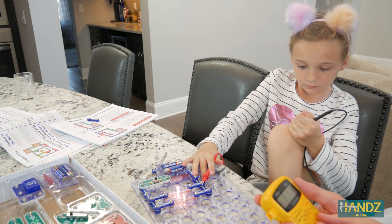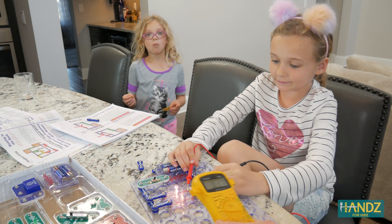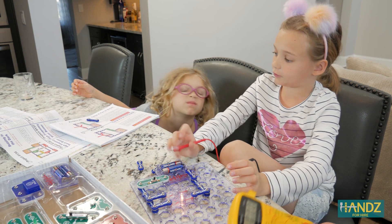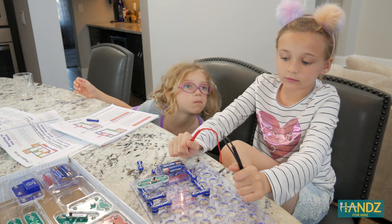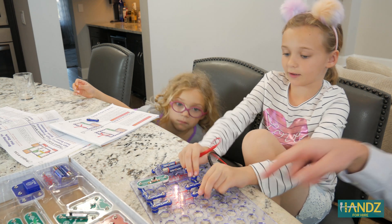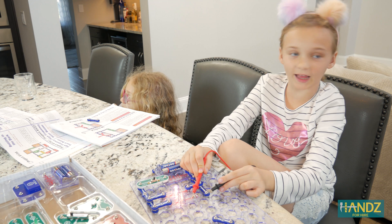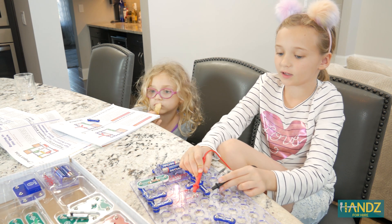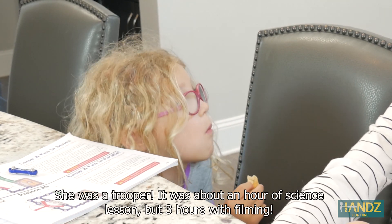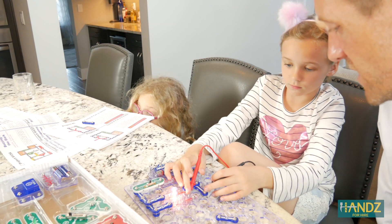Let's do the current measurement. Switching the multimeter back over, we measure the current across that one and it comes out to 0.18 amps. What was that bulb when we did just one light bulb? It was 0.18 amps — the same! So now we have the same amount of current going through it as with just one light bulb. The other bulb reads 0.17 amps. You can actually calculate the resistivity in each one using Ohm's Law, but we'll get to that another time.